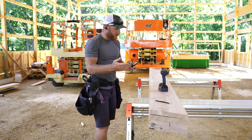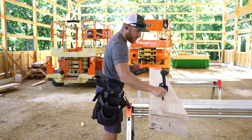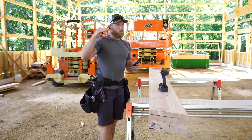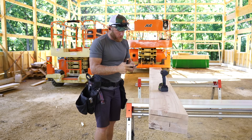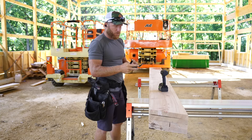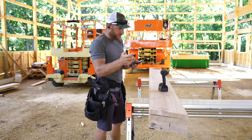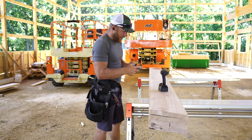That's going to give me a rise of three foot eight inches. Now, because my purlins sit on top of this plane on the top of this truss, that three foot eight rise is actually where the roof line is going to plane in from my fascia to the wall. So I need to take away the dimension of the purlin, which on a 4/12 pitch is three and thirteen-sixteenths of an inch. So minus three and thirteen-sixteenths — that's three foot four and three-sixteenths — that's my new rise.